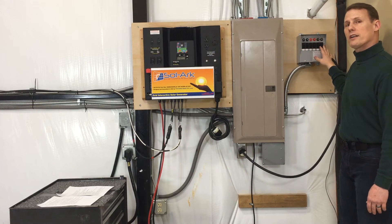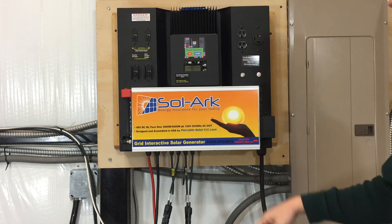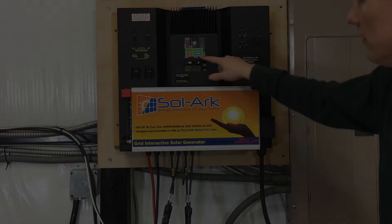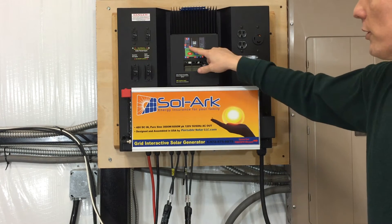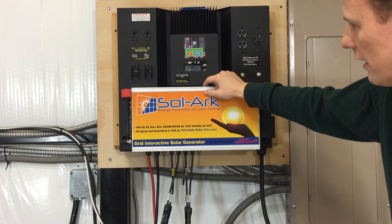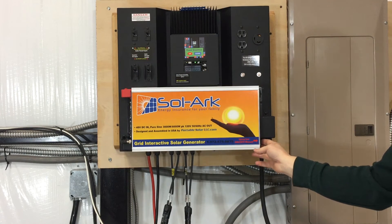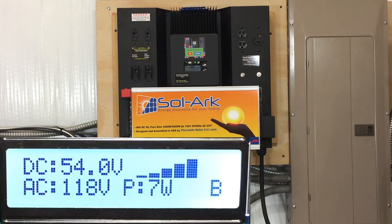Everything's working, so that means I've wired in my switch correctly and my outlet power is correct. Now let's go ahead and power up the solar arc — we'll plug it into the grid. Step one: attach the battery cables. Step two: connect up the solar wires, which we've already done, and plug it into the grid. Step three: turn on the solar charger. Step four: turn on the solar panels — we can see the solar panel light up. Step five: turn on the inverter breaker. Step six: power up the inverter. After just a few seconds we should see it power up and get a reading on the AC output of about 117 to 120 volts.